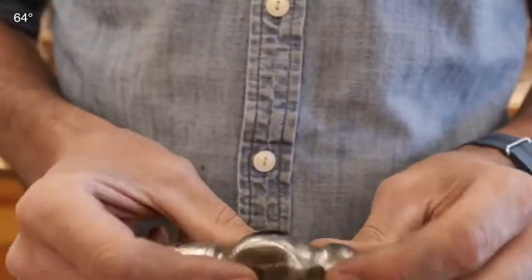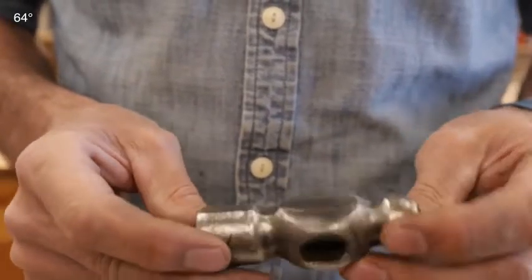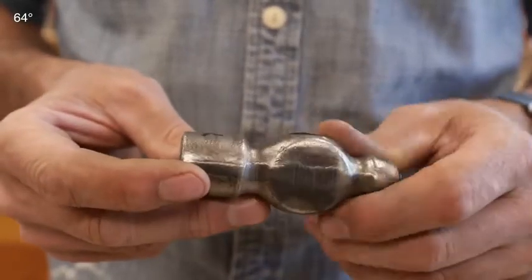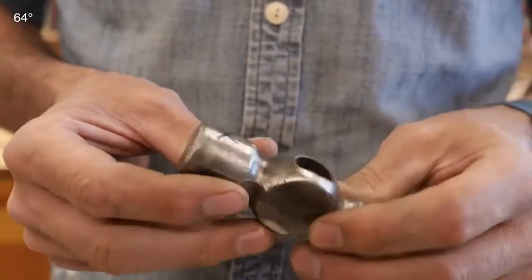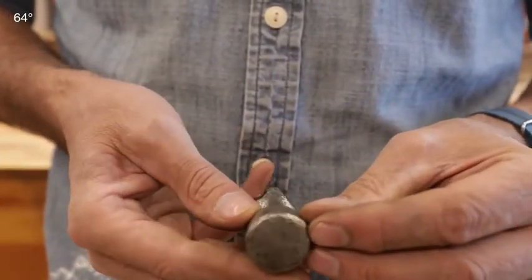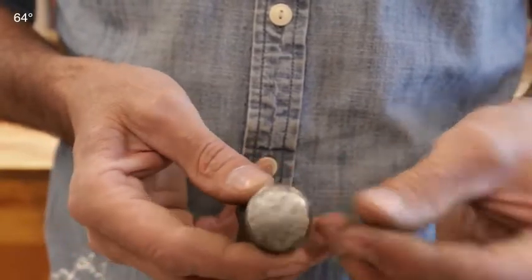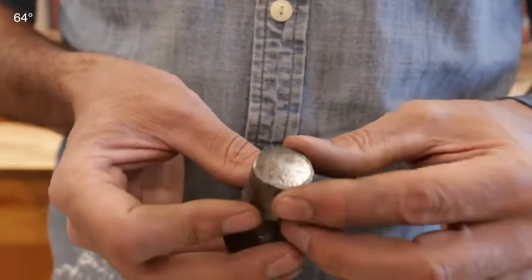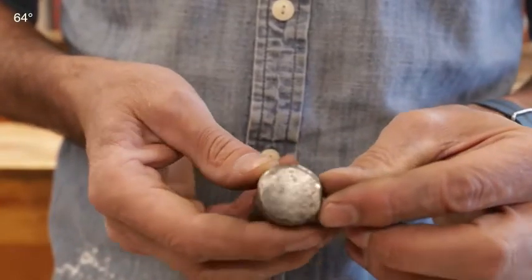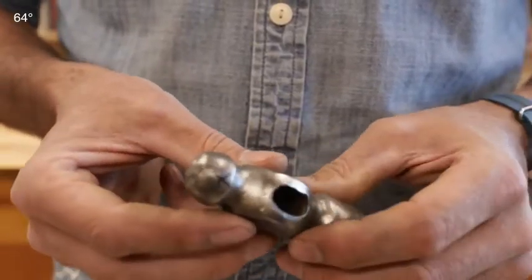Alright, we kept our marks right there. So now we've really got to inspect the hammer. If you're going to go to a lot of trouble making a handmade handle, you don't want to make it for something that's damaged or cracked. Overall, this is in really good shape — we can see that the face doesn't have a lot of chipping. When you're looking for these at garage sales or antique stores, you should be able to buy them for anywhere from 50 cents to two dollars. If they have a lot of heavy chipping on the edges of the face, you might want to continue looking, unless it is a family tool that you want to keep.